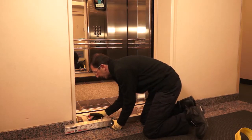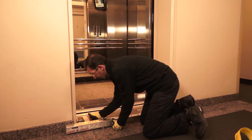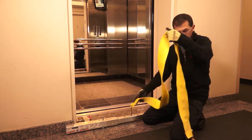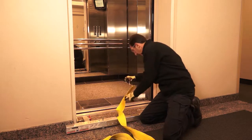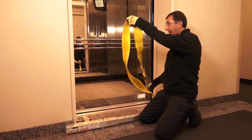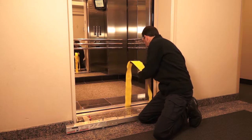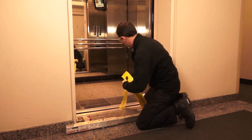So for now I'm gonna lock the anchor into place. That's locked in, and here's our sling or lanyard that we're gonna be connecting to when we're entering the pit. The next step is to connect this to our anchor and then lower the lanyard. So now at the floor below we can connect to this lanyard with our harness and the self-retracting lanyard and enter the pit.